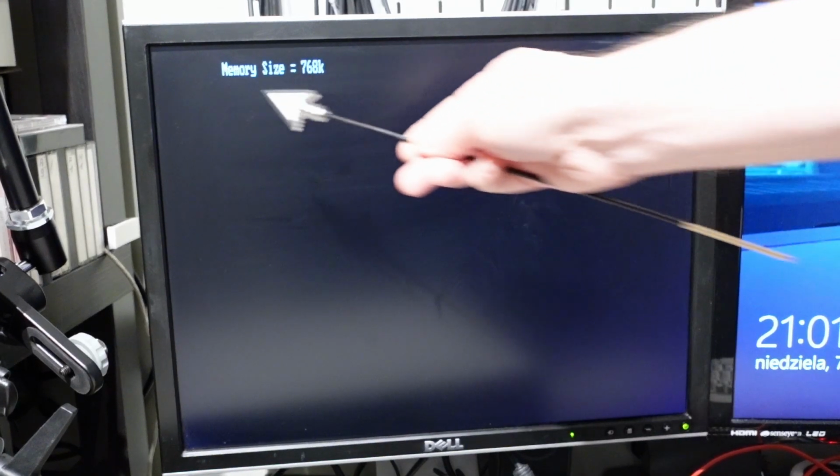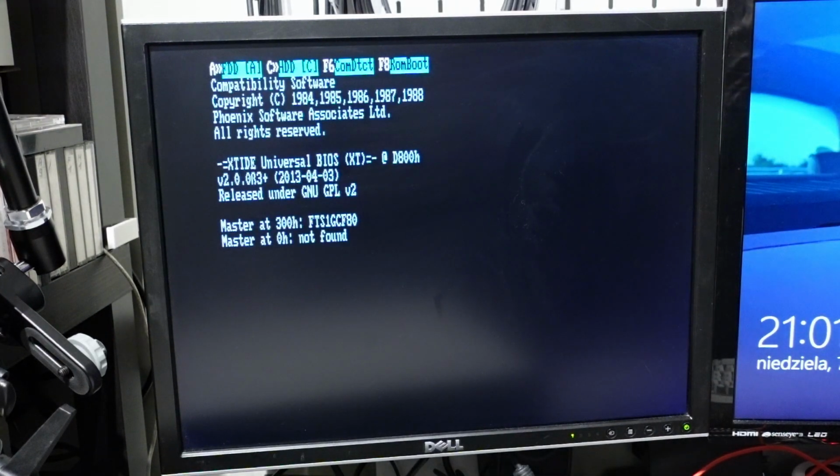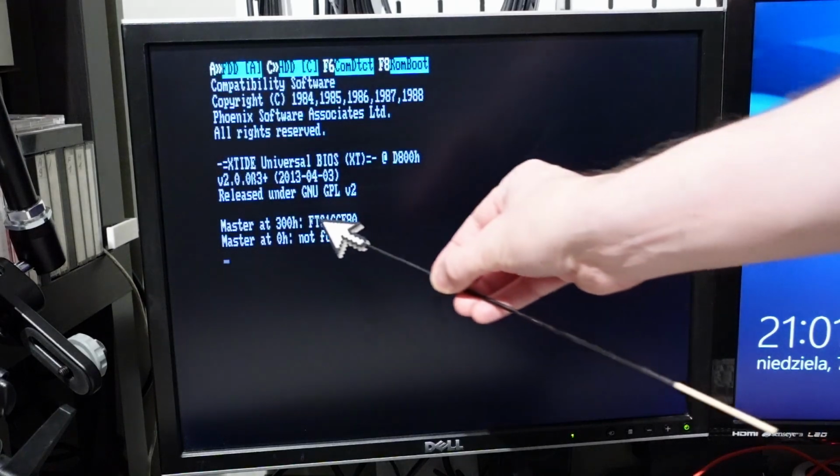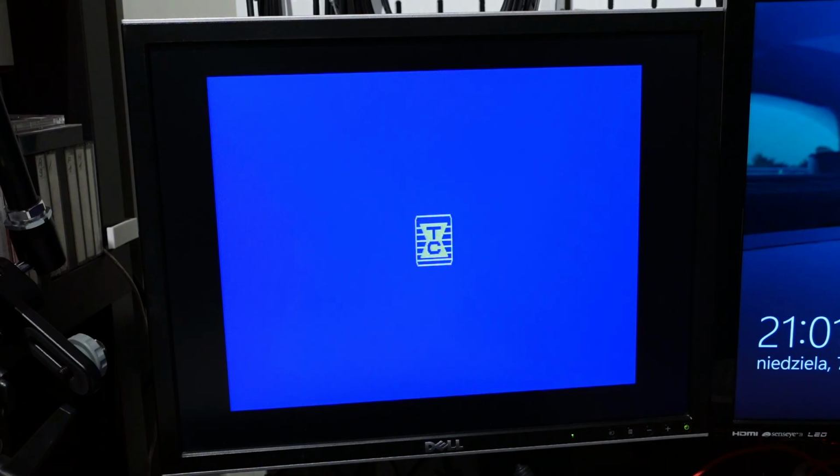Much better already. The computer starts up and reports the memory size. 768KB indicates that it correctly detects the extension we installed earlier. The card is blank, so the DOS installed in the computer's ROM boots up and the DeskMate graphical interface is started.